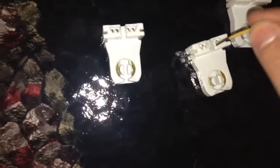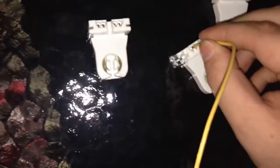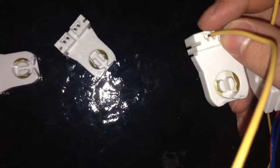This wire is coming from the ballast — I'm going to go ahead and put it in right here. Now the wires that I cut, I'm going to put them to another tombstone like this. I'm going to connect it to this yellow one right here. So that's how it's going to give power to the other one.